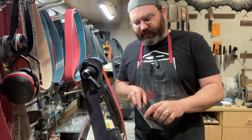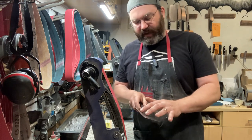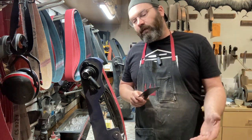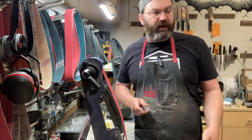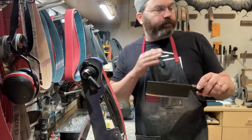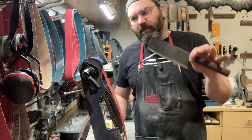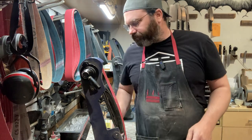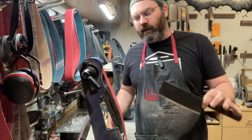But the initial grinding to get this off, remember, this is stainless clad, but it's blue super, Takeda San's blue super. It's very wear resistant, abrasive resistant, so it takes a little bit of time. That's why if you're sharpening these knives at home and you're wondering why it's not getting thin, the steel itself is made to be resistant to abrasives. That's why this blue super steel is so good. It's magic. It's literally super.